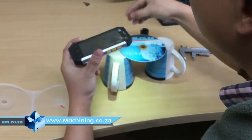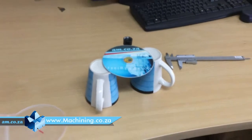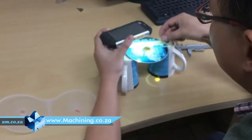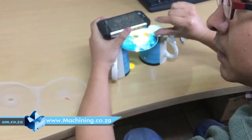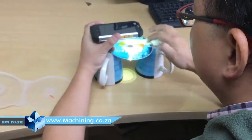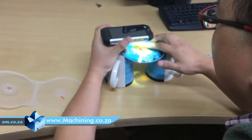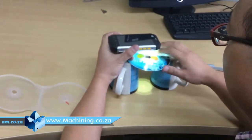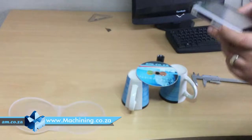Now let's give this one back. Let's take another one — 63.5. You have to keep the distance the same when you do the test. Now the focus spot is about that size, and this one is also about that size. Don't worry about the light density, because laser light is different from normal light. So now we figured out this lens is 63.5 millimeters.